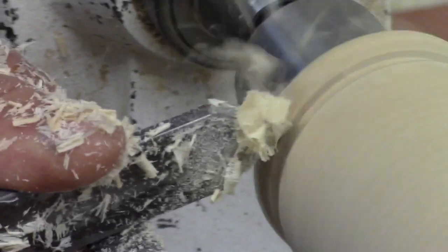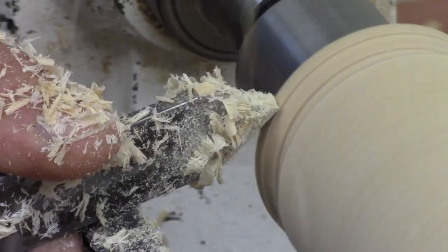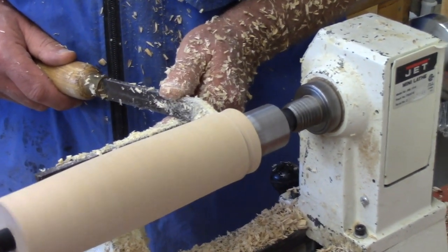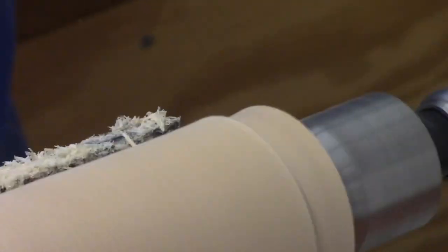I'm sliding the tool over, and since I did about 6 or 7 segments in cutting there, I'm only going to be doing like 4 or 5 here, and then only 2 to 3 here. And you can see from the profile how this dovetail is starting to appear. So I'm just going to clean it up gently. We don't want to skate the tool back and forth. It's just light steps from left to right and then right to left. And what is my tool at? Probably about a 3 to 4 degree angle. That's about it. And there it is. So Mr. Wilson, maybe you can come perpendicular to it, you can see the dovetail. Okay, perfect.